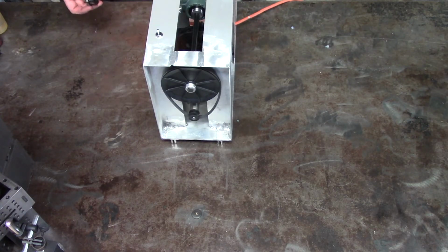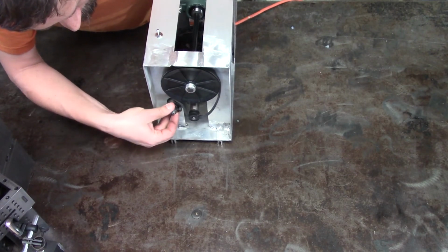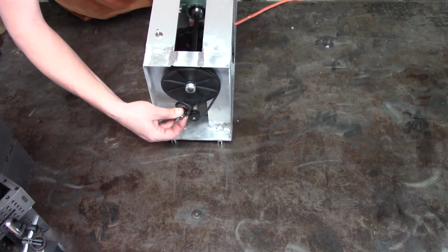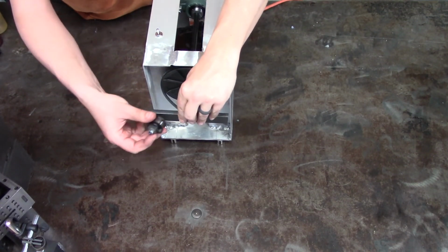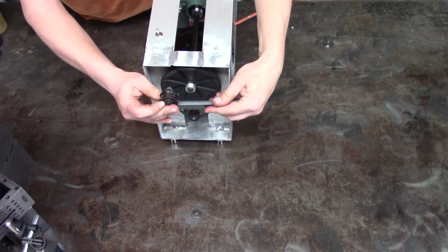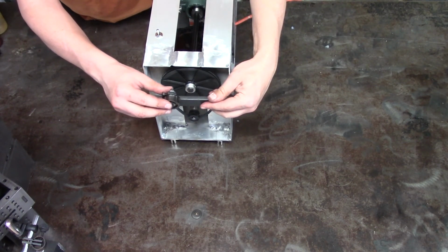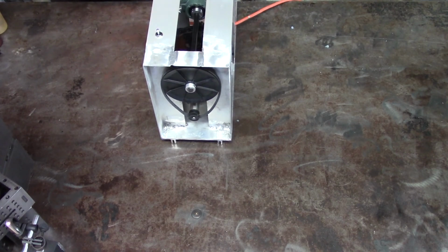So our next task will be to install this belt tensioner here. Come from the side here and use it to tension this belt. It'll also give us a little better contact on that small 1-inch pulley on the bottom, giving almost 180 degrees of contact on the belt. Run up some kind of bracket to go behind it to mount this little pulley on, and then push it into the belt with another set screw or threaded rod or something similar like that. But that'll be for the next video.